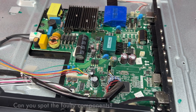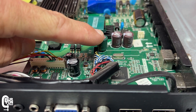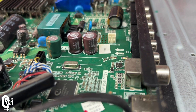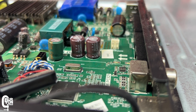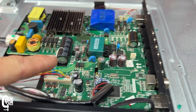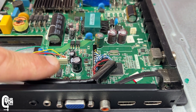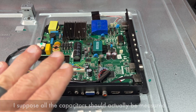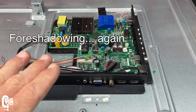There's a little bit of dust we need to clean off, and here are the telltale signs. Normally a capacitor is supposed to be very flat on the top, but have a look at these ones — they are actually slightly bulged on the top. Those capacitors have failed. Looking at the others: that one still looks pretty flat, that big one looks pretty flat, this little one here looks a bit bulged as well, and then this one still looks flat. Without measuring anything, those need to be replaced straight away.